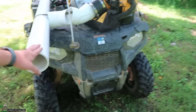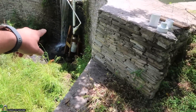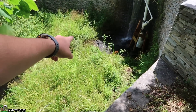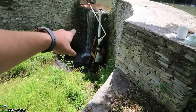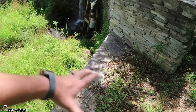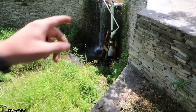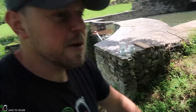I'm going to be putting a 4-inch pipe — instead of going straight down to where the bucket is currently, I'm going to put a 45-degree fitting and go way over into the water down there. That will hopefully do two things: increase the down pipe by two more feet, and also prevent the water from having to hit that bucket and turn back up. Now the water should be able to flow down and straight out back to the creek.